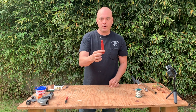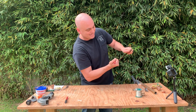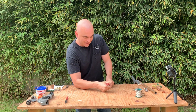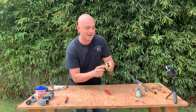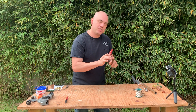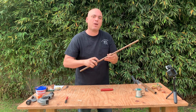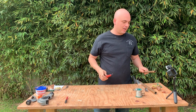Next you need a reamer. You always need to ream your pipes — that's basically deburring the pipe. You have the pipe here and you need to remove that outer little lip. The reason that is done is because without reaming each piece of pipe that you cut, the water is going to have a swirling effect, and that will cause pinholes down the line in your copper lines. So it's an absolute must.